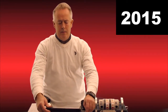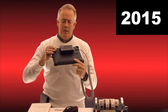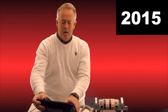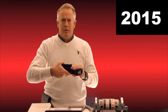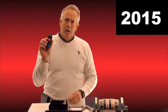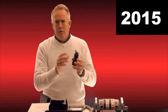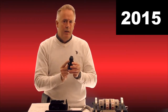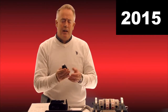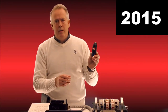Our standard wired system that everybody's come to like is still on the market today, but for 2015 we have gone wireless. What I'm showing here is our carrying pouch for our wireless device. This is our new wireless accelerometer. It is a two-channel device, so you can hook up a second channel tachometer for balancing or a second accelerometer for phase evaluation. We have an app called Phase Pro that will walk you through how that's used. Very useful tool.